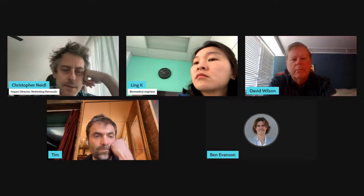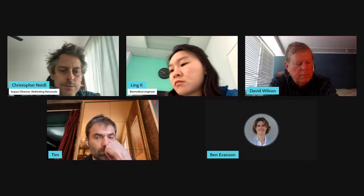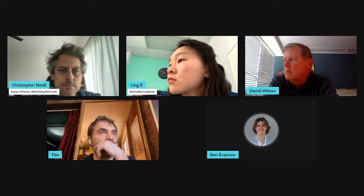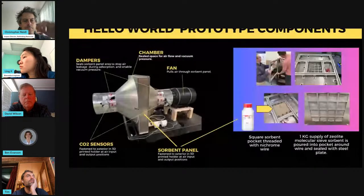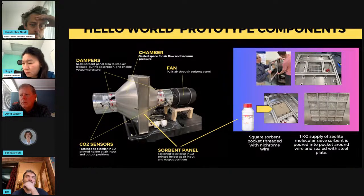measure the CO2 flux coming off of it, or in this case, our mass flux. And then we take that mass flux and back out that it was all CO2. That's an assumption that we made. And then set it back down to 25 degrees C and let it adsorb for about an hour, and then do that same process again. And so what that means, Tim, is that it didn't get to fully adsorb across each of those 60 minutes, because you see that decreasing sorption capacity. It's also difficult because there's degradation happening at the same time. Both of those variables are confounding, but below 100 degrees C, we can make an assumption and say most of what we're seeing is just incomplete sorption instead of degradation. Does that follow?